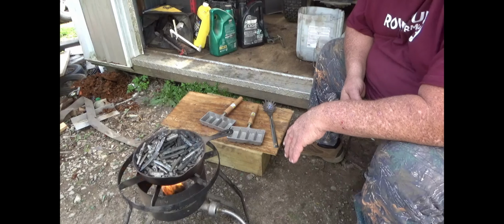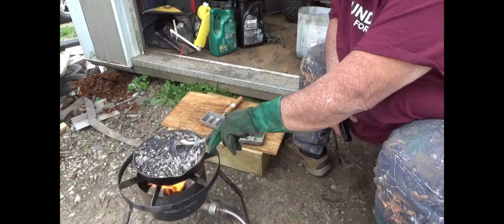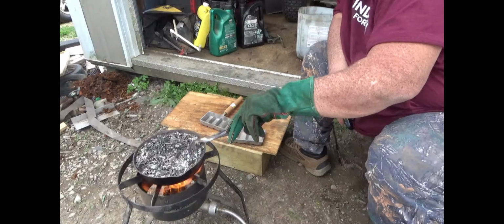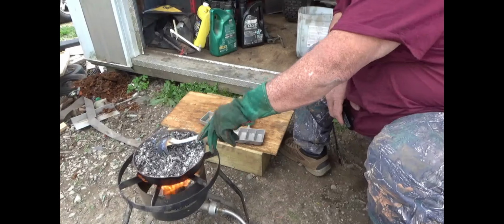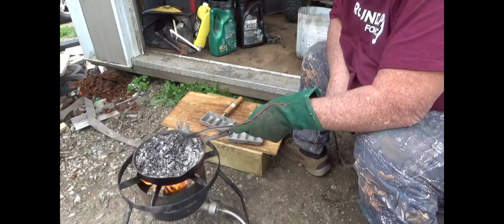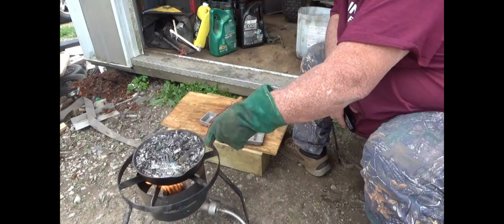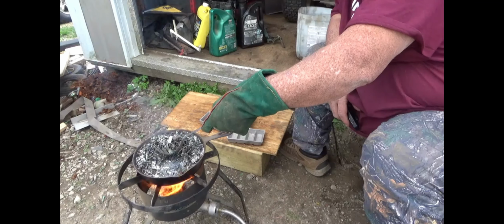We're almost finished. We are pretty much right there where we want to be, ready to start taking out our clips and removing all the trash. Right now at this point, if you made a mistake and you left a zinc wheel weight in there or a regular old steel wheel weight, this is where it would show up, because right now we're not to the temperature in this pot that it would take to melt zinc, but we're melting lead. And if it's in there and it won't melt, it will float to the top, because the lead is heavier than anything you put in there, so the lead's going to go to the bottom.